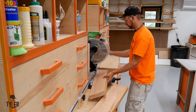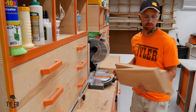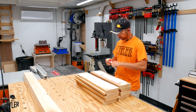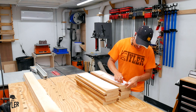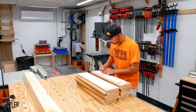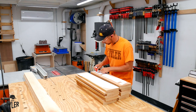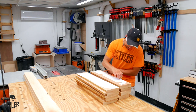So that's what we're going to do here. We're going to head over to the miter saw, cut those down to the lengths so we can work with them and get those nice curvatures that we just talked about. These are the bottoms and the back of the bench. I'm going to go ahead and glue down the paper template to one of these, cut it out on the bandsaw, clean it up on the oscillating spindle sander, and then use that first one to trace out and router copy to get exact copies.